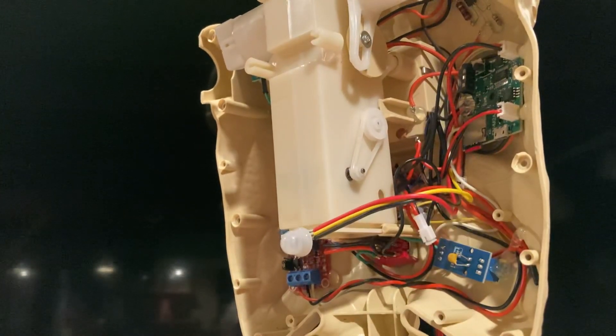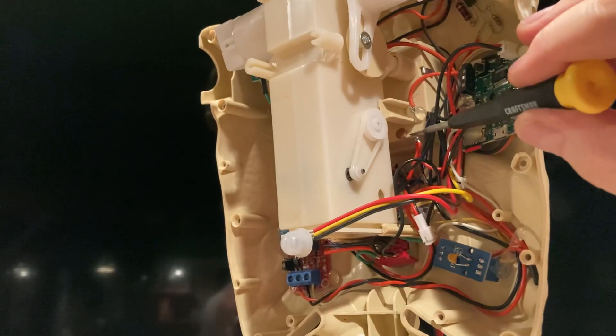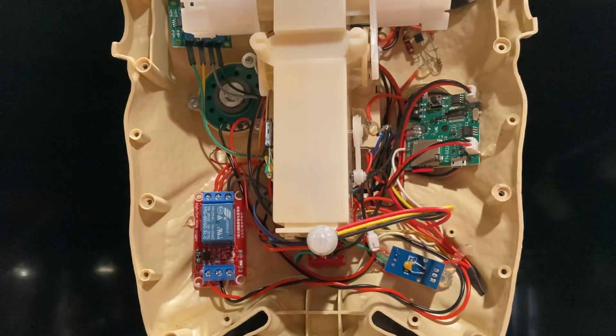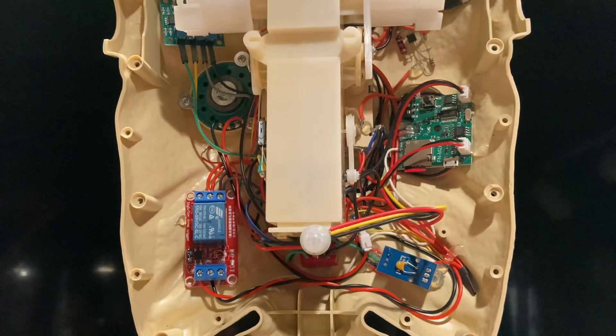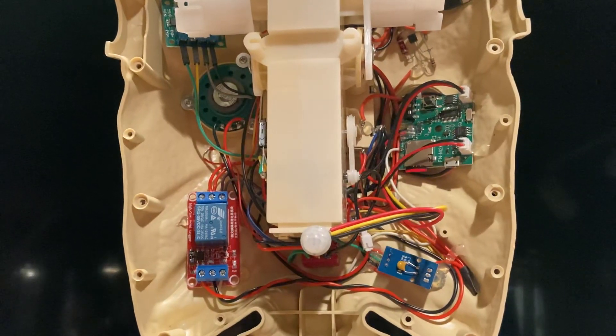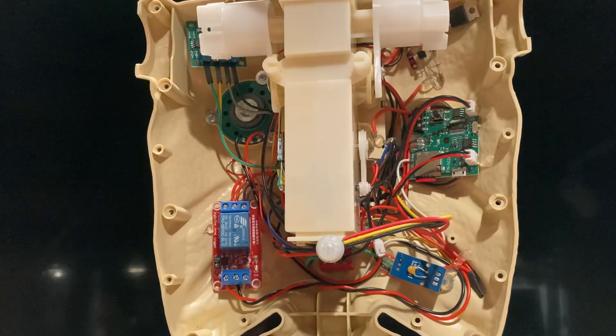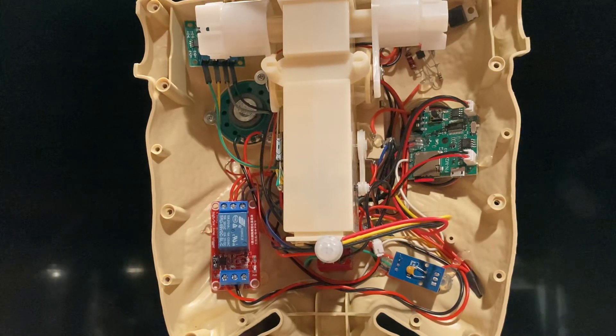I had to make a modification: I put a 100 picofarad capacitor right here in the audio line. This particular amplifier was apparently generating something that the mouth didn't like and it would just lock wide open. Putting the capacitor in there filtered that out and I don't lose anything by that. The whole thing is working as expected — actually it met and exceeded my expectations. All of this was tested on the bench first and then I put it to use. That's it — I'll come back with more videos, and as always, thank you for watching.